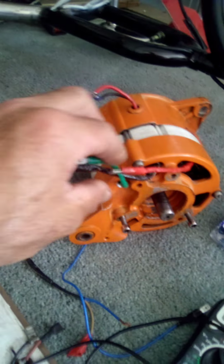As you can see over here, I've taken three wires coming out, back to here, back up to here, and back to the controller, where it would generally come out to run your brushless motor. This is a brushed motor. This has brushes in it, and it runs off direct current, like directly off one of these batteries. So I was scouring around on the internet and I could not find one of these videos, so I thought this would be a good idea to show you guys. This is how you can run a DC motor off a brushless controller.